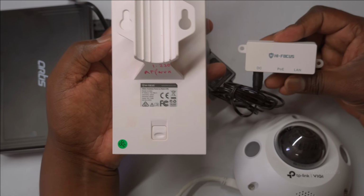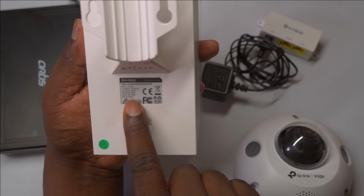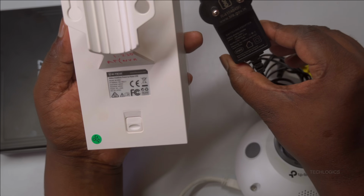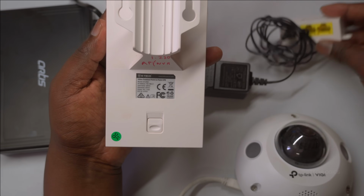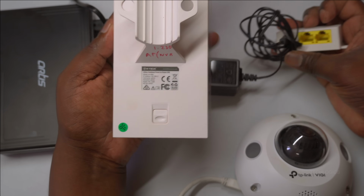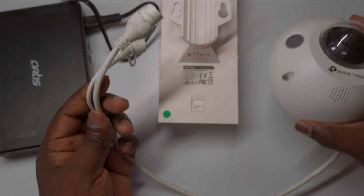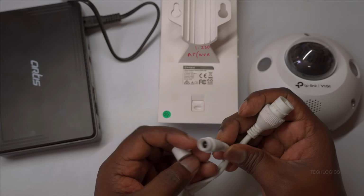Note, this UPS comes with a PoE port that has a switchable power supply feature. You can set the power output to either 12 volt or 24 volt depending on your device requirements. This flexibility allows you to connect various DC PoE-enabled devices such as access points or wireless bridges that operate within a voltage range of 9 volt to 24 volt. However, ensure that the current drawn by your device does not exceed 1.7 A, as this is the maximum rated current for the PoE port.